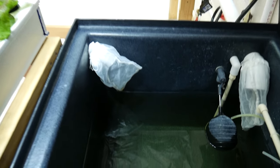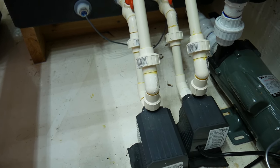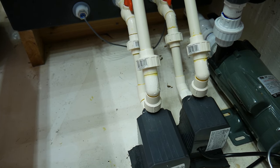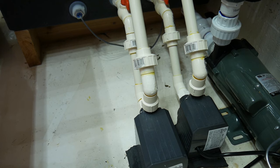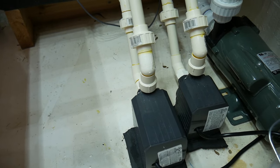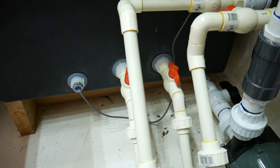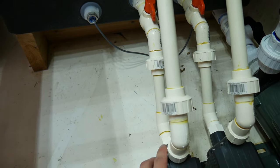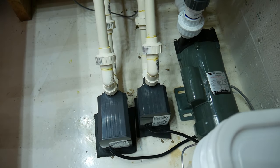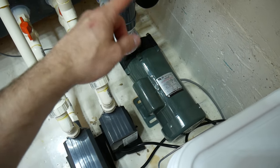These pumps are placed on the outside of the tank for two reasons: it helps keep the tank cool since the pumps generate heat, and they don't add as much heat to the water as they would sitting inside. It's also much easier to swap them out if there's a failure — they're easily accessible. You just turn off the valves on the intake and output, unscrew the union joints, and remove the pump. There's also a larger pump down here; since we're in the basement and can't gravity-drain, this pump empties the tank when needed.